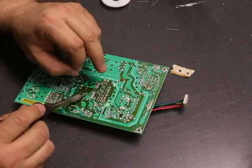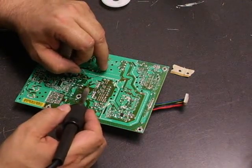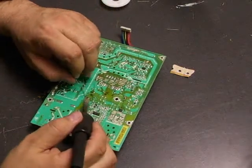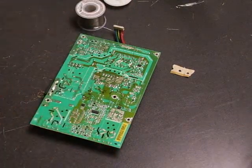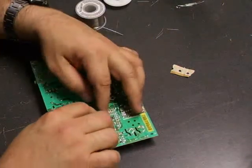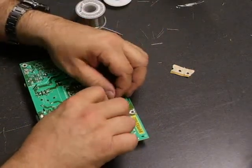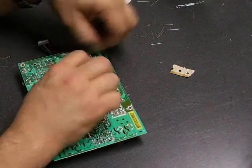You need to make sure that you are using the right capacitors for this repair. Standard capacitors from a store like Radio Shack or a local electronics store probably are not going to work. They need to be what are called low ESR — equivalent series resistance — and they need to be high temperature and high ripple current rated. If they are not, they will die very quickly and could potentially damage other components on the board. We have the correct parts in the repair kit available at the link below, so you don't have to worry about getting the right values, ratings, or physical sizes.